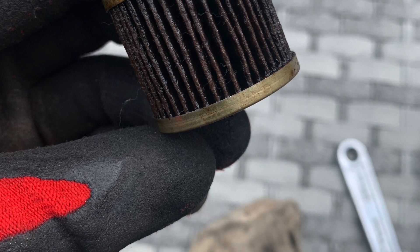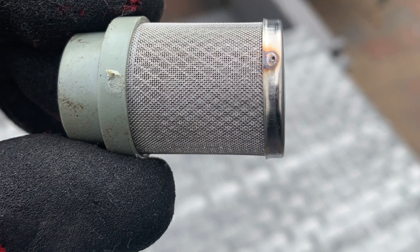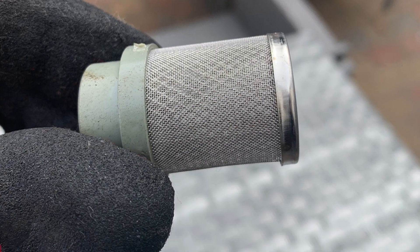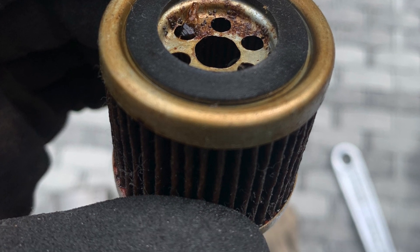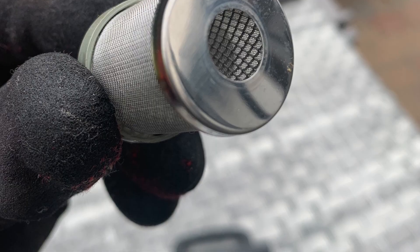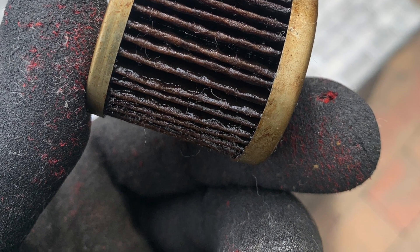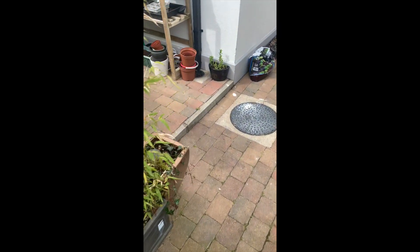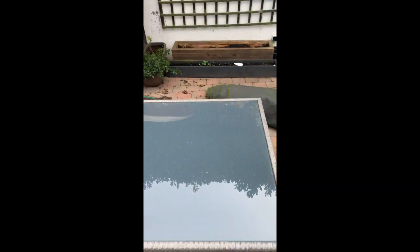Changing these filters turned out to be rather optimistic — it didn't work, but it didn't do any harm either. The problem is that when the central heating comes on, because it's suction fed, it literally sucked the oil up from the Aga line, meaning no oil was getting to the Aga. We're about to find out why, but changing the filters didn't cause any problem. One last look at that dirty filter.